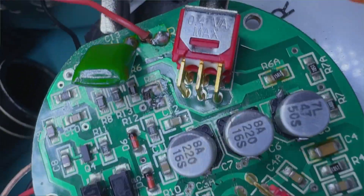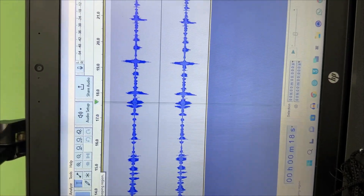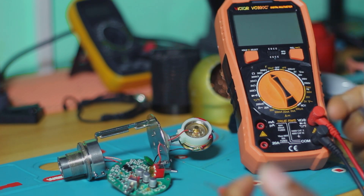I placed the resistors as you can see, and the microphone works. I can't say the quality is the best — the resistors I put in are not the same value as the original 6 megaohm, and the capacitor I used isn't exactly the right type either. But the mic works and I'm so happy about that. We have all the tools we need to troubleshoot and identify bad components — tools like our multimeter — but we're lacking the self-confidence to take the time to do this properly.